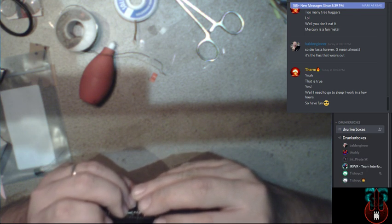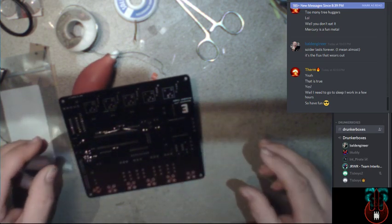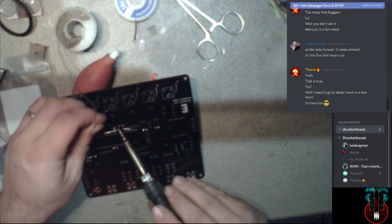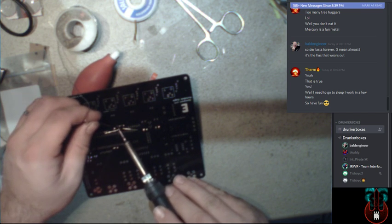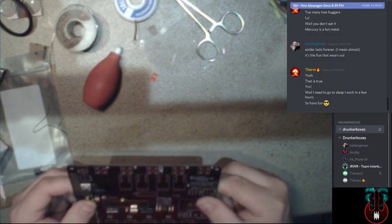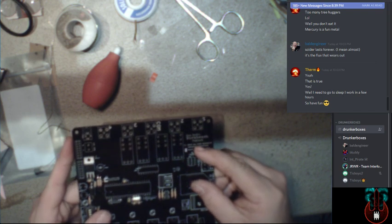I've been working on my pirate badge. It's coming along nicely. Actually found some code to do 4 PWM channels on a Tiny85. Really? Yeah. Is it pins 0, 1, 3, and 4? That can't be hardware, right? Not all the pins are tied to a timer, are they? It's a weird register hack that you can do. Now 3 and 4 share a similar timer between the two.